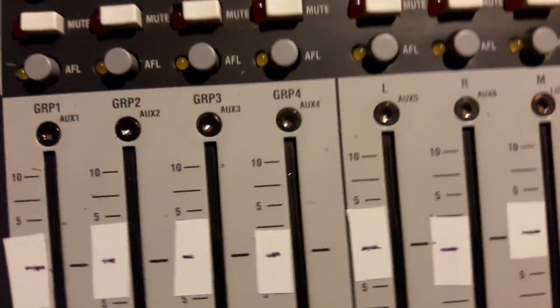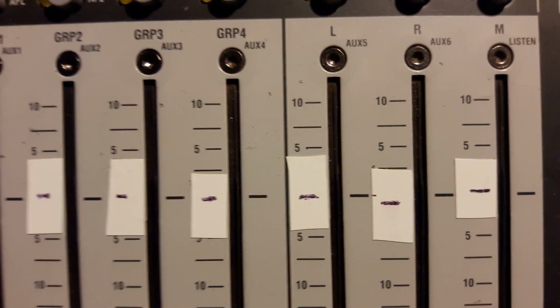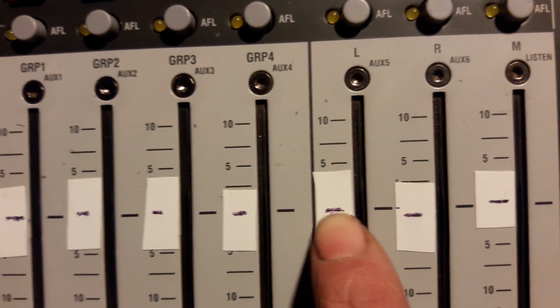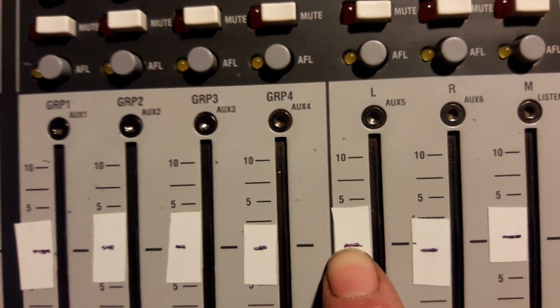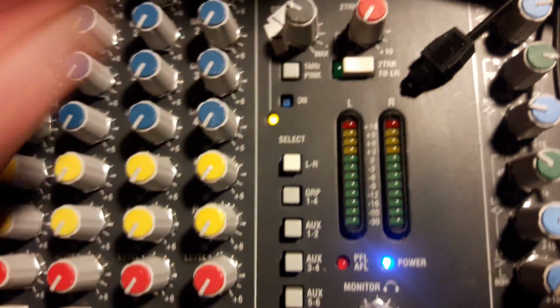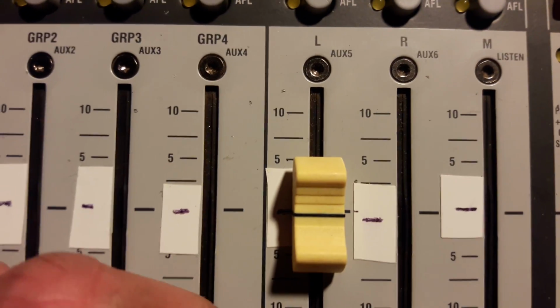And what I did to verify is I used a digital meter, and the digital meter, I'm not too concerned about, it's like 1.2 volt, 2 something volts. I'm not too concerned about getting it perfect. I'm more concerned about finding out which one of these is higher than the other and then putting it at 0, and then bringing up this output so that they are equal. Okay?